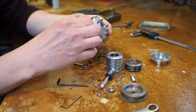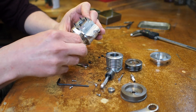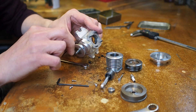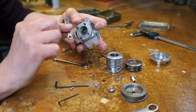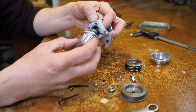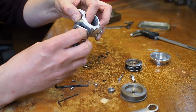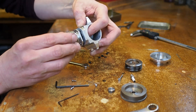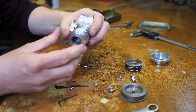Then five very small domed cap head bolts just locate the front of the crankcase - I'm just going to put two in for the moment and do them up. We then have to get the piston and conrod on, which fits on the main bearing. Then we put the crankcase over the top. There should be a mark - that little dimple there will line up with a dimple on the cylinder - a marker to make sure when you line it all up you put it in the right way around.